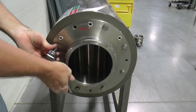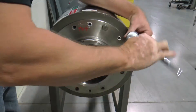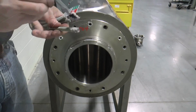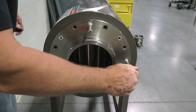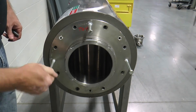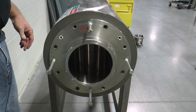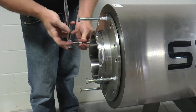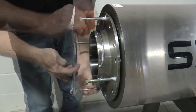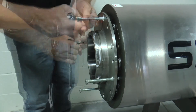Remove the eight 3/8-inch bolts that hold the removable tube to the jacket. Take four jack bolts and thread them into the B-holes, which are located at the 12, 3, 6, and 9 o'clock locations. Do not tighten yet. Using an X pattern, gradually tighten the bolts to withdraw the tube from the jacket. Considerable effort may be needed to overcome any stickiness.